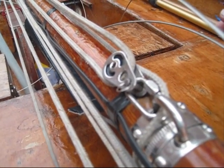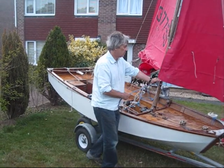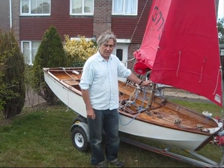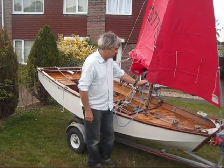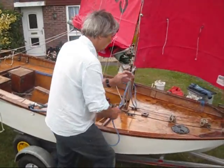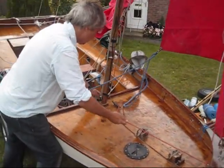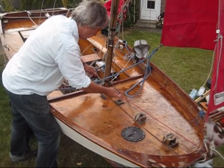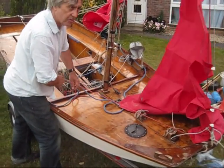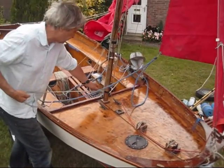That's in addition to the standard halyard sheave that you get on the mirror. So now I'll show you what happens with the jib. To be sure I'm getting it down in a blow, there is here a downhaul, which is attached to the top of it. So we've got the halyard going to pull down the jib on that one. Because it won't come down by itself, probably.